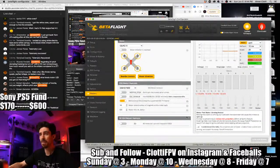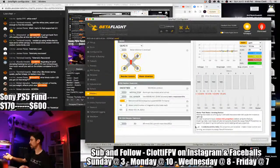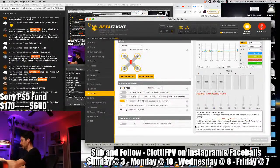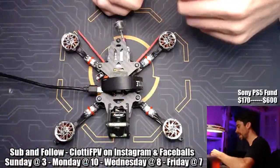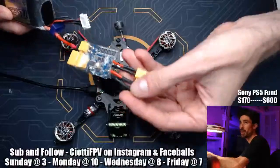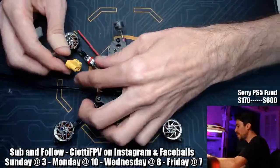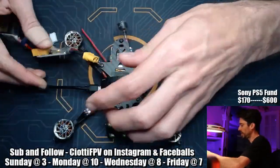You come into the motors tab. I wonder if this is going to need an ESC update. Hey, this is also the first time I'm going to plug power into this rig, so let's go to this camera just in case it catches on fire. And I'm going to use my ViFly V2. This is the only smoke stopper that actually works. If you have any other smoke stopper, don't throw it away. Throw it in your flight bag. And then buy one of these for use at your bench.